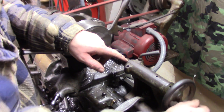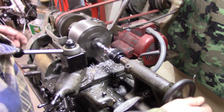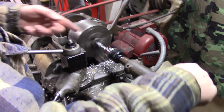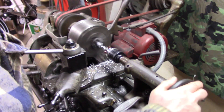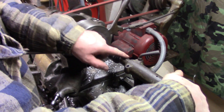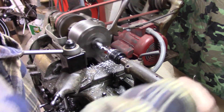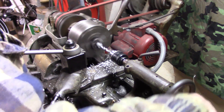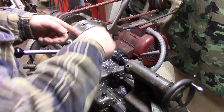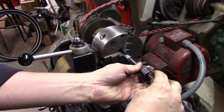This thing's got a graduation on here, and I've got a little quarter-20 stud that's going to go in here after it's tapped, and half into the handle. I'm doing this an inch on these graduations and splitting the difference — half into the handle and half into the tap threads I'm going to be putting in here. I'm going to get something a little better to hold the tap with.